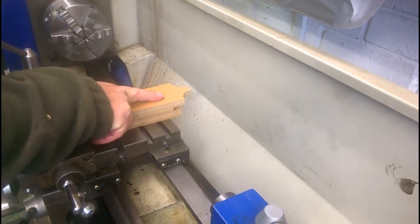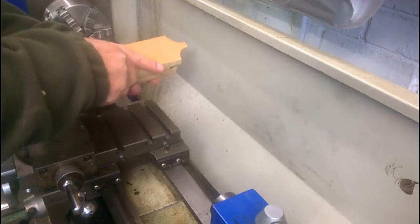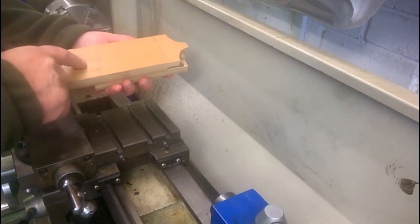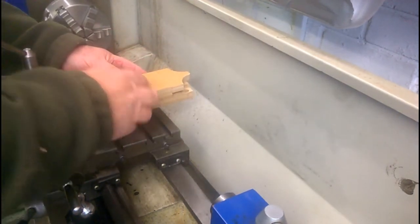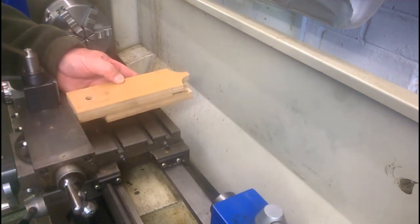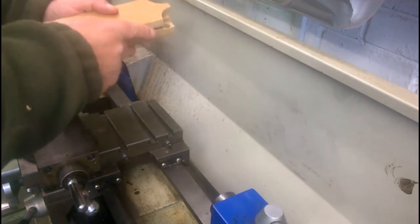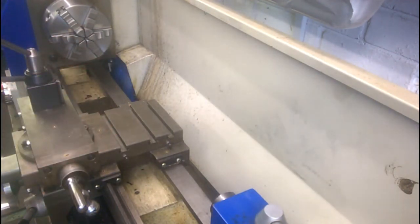Then as the cross slide traverses along the length of the bed across the template or whatever you're copying, this tool post, which is remounted in here under a pair of springs which hold it against the work along the center line of the lathe, will progressively, obviously by moving the cross slide in, follow the template and move back and forth. I haven't explained that very well, but hopefully it will become clearer as we progress through the project.